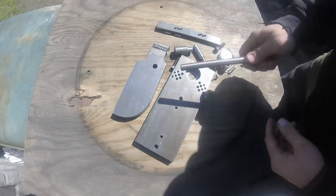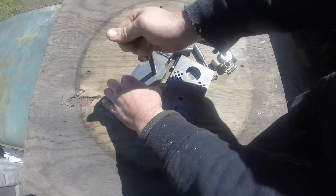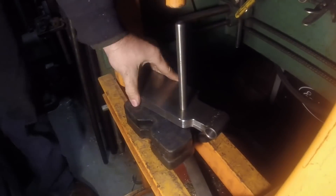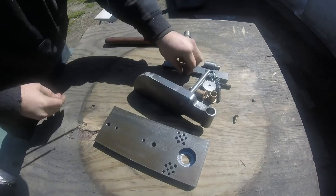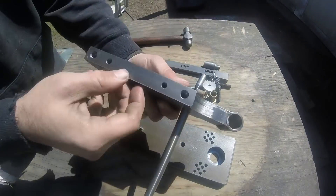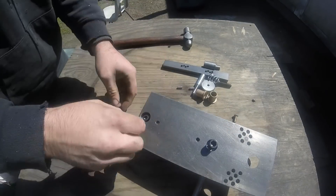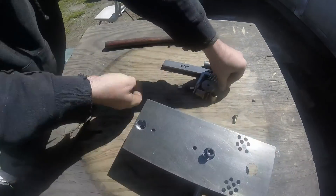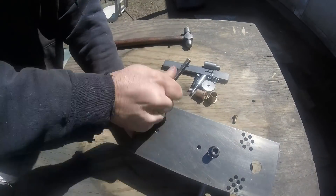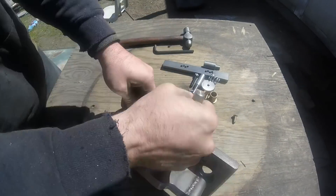Here's most of the components. The first thing I have to do is press this bar in here and then I can assemble. I'm using pins because I wanted to make sure the alignment was accurate — there's not much play in the punch and die — and just using the bolts wouldn't have gotten me as close as I needed to be.